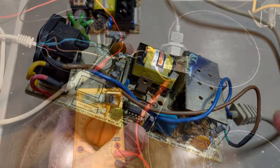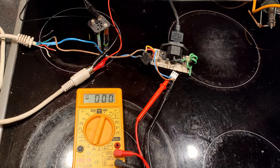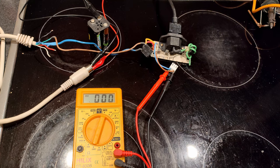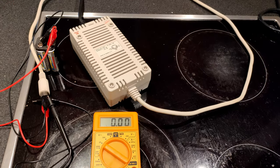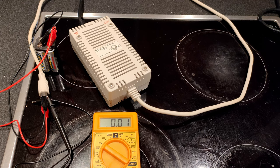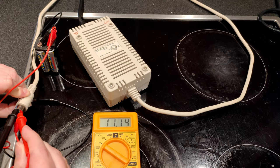Magic cut to board in half — and there we have it. I've got some battery power to activate the relay so I can check it works and gives me mains power, and that it's the right way round. I do have the wire colours the wrong way round, which was a bit of a mistake, but it's the right way round for the power supply. I've connected the new power supply up to the old bits and pieces to get mains voltage, and I'm checking that the output actually works, the thing doesn't blow up, and I'm getting the voltages I expect on each pin. I've matched the outputs on the round connector — there's a very helpful diagram on the bottom of the power supply. I traced them through earlier with a multimeter to check which colour wires inside the box relate to the pins and which voltage is on the outside. I've lined them all up with the power supply connector, clipped it all in, put it back together, and got a nice original-looking bit of kit.